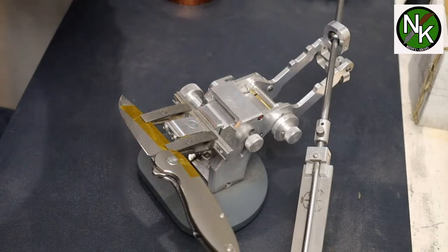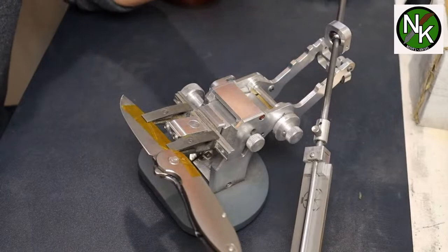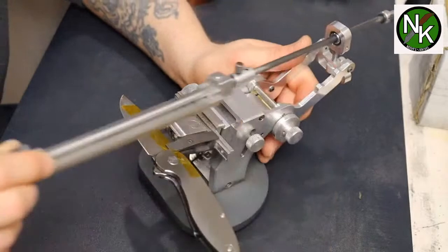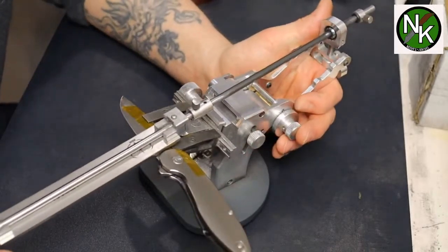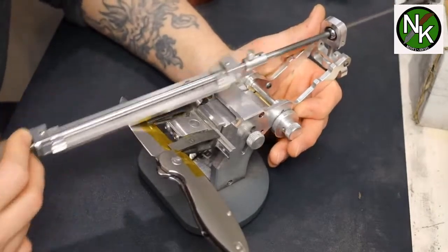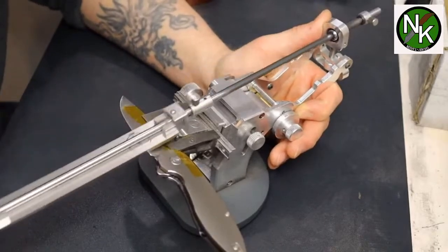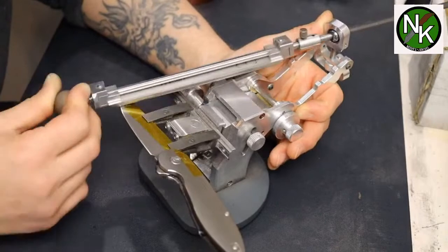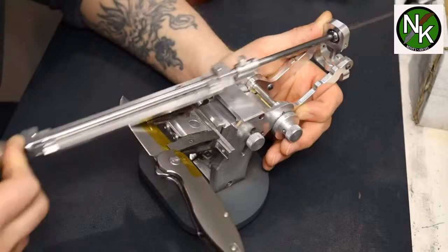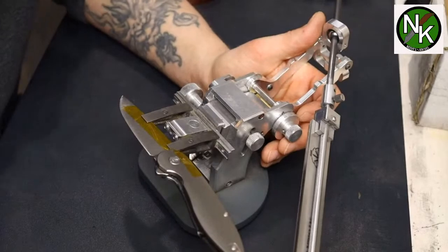I also heard that from multiple other people as well. Now, if you can't afford the Dragons, the Phoenixes are great. The only real difference is thickness in the resin bonded diamond. I think it's 2 millimeters for the Dragon series, and the Phoenixes are 1 millimeter thick. That 1 millimeter will last a long time, but imagine if it were double as thick. A Phoenix already lasts a long time, so if you have the Dragon, it's going to last you a long, long time. I do a lot of sharpenings, and mine hardly look touched.